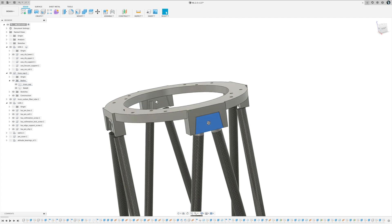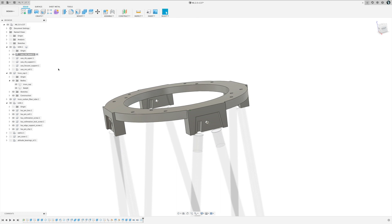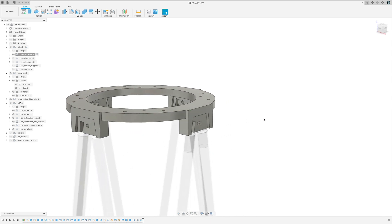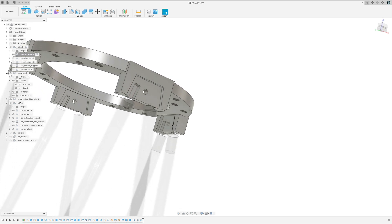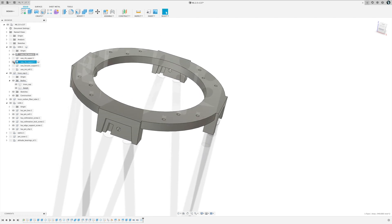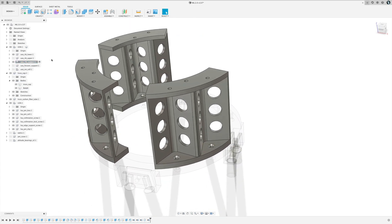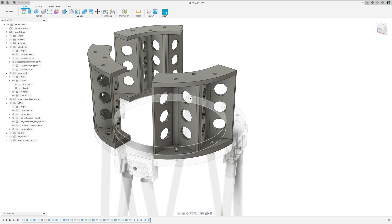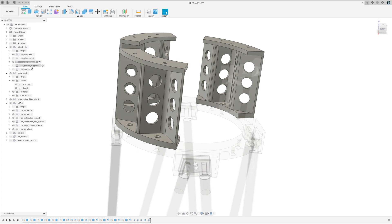The first component of the upper optical assembly is the lower ribs — a single printed piece. It's designed to fit with the truss caps, with a notch on either side, so it's a sandwich-style connection. There are three holes around it that support what I'm calling the rib supports — three independently printed pieces with cutouts to make them lighter, let air through, and a zigzag pattern for strength and rigidity.